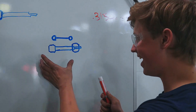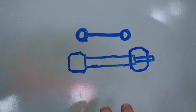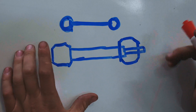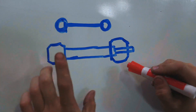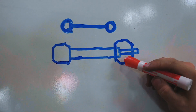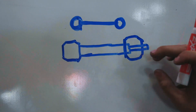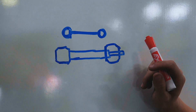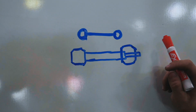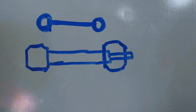We have the basic outline of the handle here. This is a little bit scaled up because the real handle is going to be three inches long overall, which is teeny. We're going to make this thing in two pieces - we'll have a meatball on either end, and one of those is going to be the same piece as the actual handle itself. The other one is going to be riveted on, so we've got to turn down a tenon inside the other meatball. Then we'll be able to round that over and file it flush so it'll look like one solid piece.